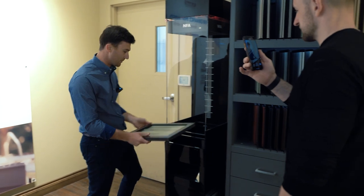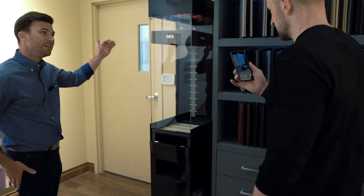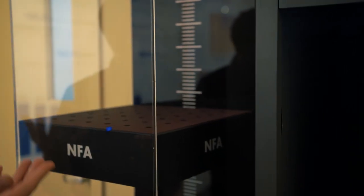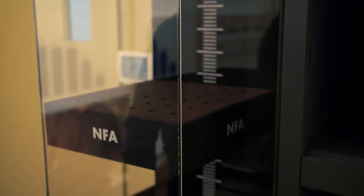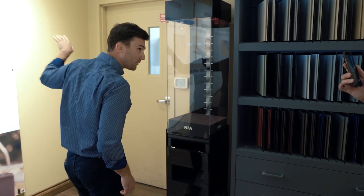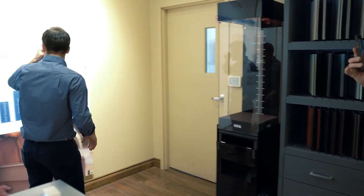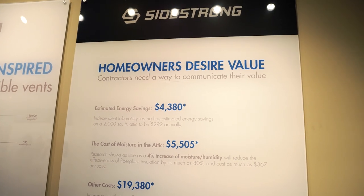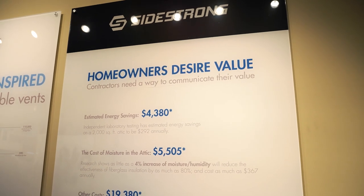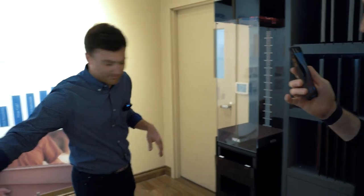This is one we bought from a distributor, and you can even see what happens to the NFA. NFA goes way down, and if your NFA is going down and the ridge vent requires an 18 but you're not getting a 9 on each side, this is what's going to happen in your attic. A 4% increase in moisture will bring your R-value down — your insulation value — as much as 80%. Now there are different installations out there, so make sure we're comparing the same to the same.